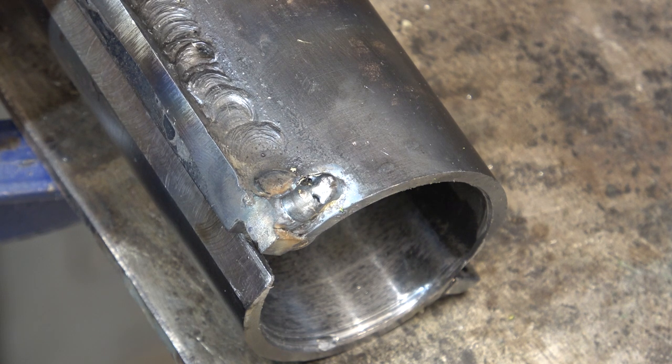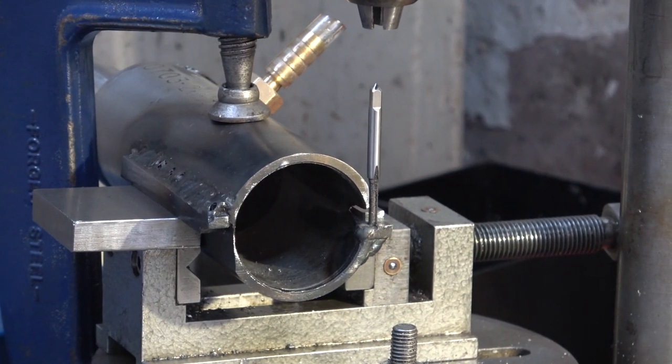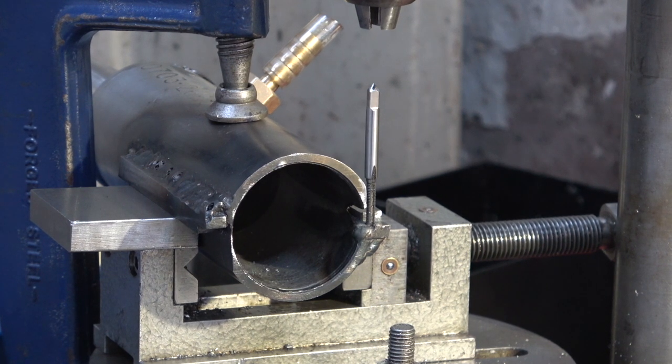Now we've got the hole filled in, I can re-drill it, re-tap it. Hopefully get it right this time. I guess it was just a piece of the design that I hadn't fully thought through. Next time, if I was making another, it would be a little bit different. I've drilled it again, and I'm in the process of re-tapping it. I am concerned. It turned out the screw I put in was a bit softer than the metal around it. So although I started at the edge of that screw, I think the drilling has moved much more towards the centre of the screw, and I think I've lost a lot of what I'd gained.